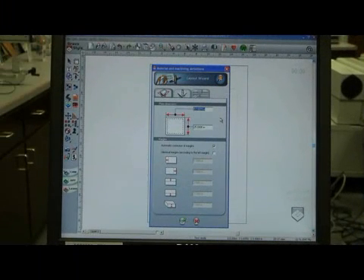Laying out an ADA compliant sign with GravaStyle is quick and easy. All I need to do is give it the width of the sign I'd like to make. This sign is 7.875 by 3.875. I'm going to tell it that I want all my margins to be 5 eighths of an inch. That makes the sign compliant — you can't engrave, or the letters on the sign can't be any closer to the edge than 5 eighths of an inch. And you hit check.